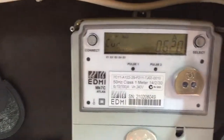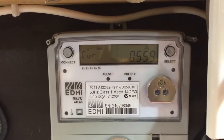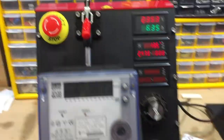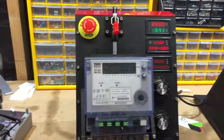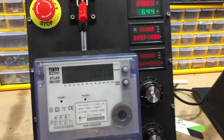You can see the power here — if I turn the switch off, you can go back to 60mA. That just shows how much this device draws. The idea with this machine is you can actually take it to the side of houses, take the meter off, and test it to see if the meter is accurate enough.